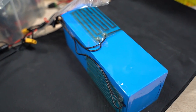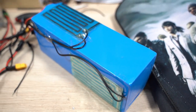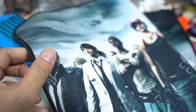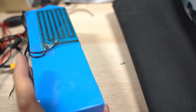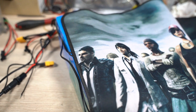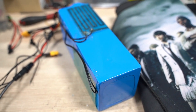So your battery stays at the ideal temperature of around 23 to 40 degrees. In a real life situation, say for the 010X scooter, all you need is these Neoprene sheets — they're very thin, less than 2mm thick. Lay one on top of the battery and one below where it touches the aluminum, and you can get pretty good heat retention within the battery itself. That is one way to implement this heat management system in your scooter in a real world condition.